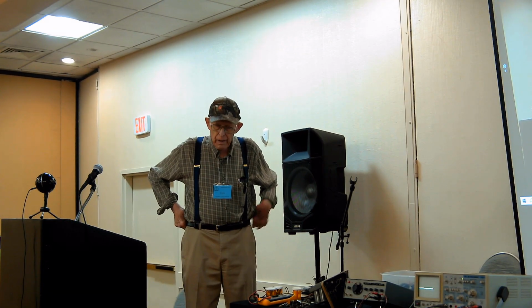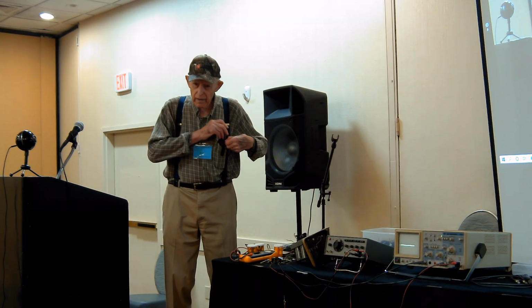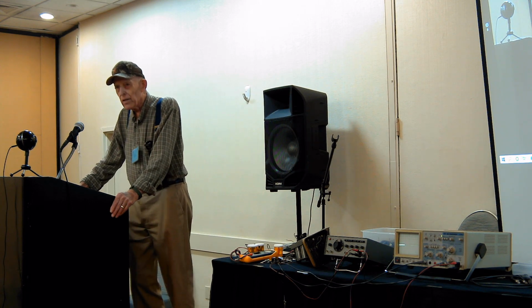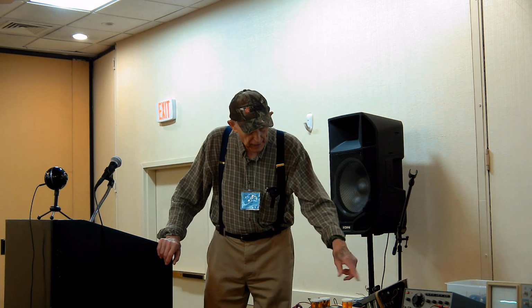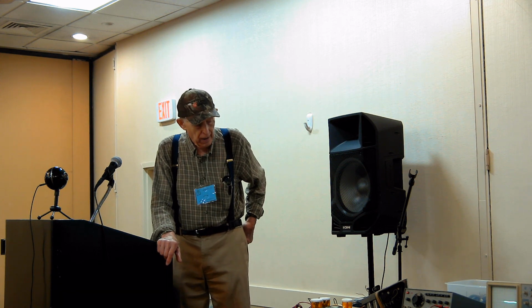I've worked with an awful lot of the MARC members who do their own repairs, and we do an awful lot of repairs together by email. I have maybe 5 or 6 messages a week on repairing radios, and in 80% of the time the repairman does not use a scope, and it's very difficult for him to understand that it's so easy to use a scope just to make one measurement, and it'll tell you whether it needs a filter capacitor, whether there's something else dragging the B plus down or not, and you'll find leaky capacitors the same way. You'll find that you'll have the same DC voltage on both sides of the capacitor, and that's not what the capacitor was for, and it's obviously leaking.